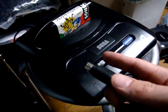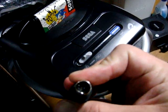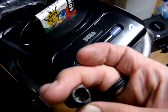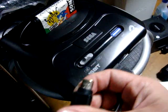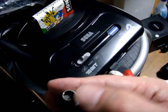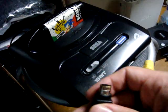When I got this machine, I didn't have an AV cable for it — and in fact, these Mega Drives are really hard to find AV cables for in Japan. So I went to good old Hard Off, like I usually do, and I found a regular DIN connector. This DIN connector had multiple cords and jacks coming off the bottom, but on the inside it had eight pins coming out. What was nice about those eight pins is that they fit inside the Mega Drive 2, and all of the pins made a connection.